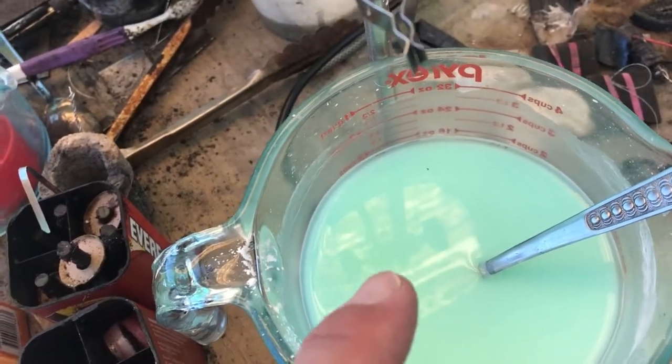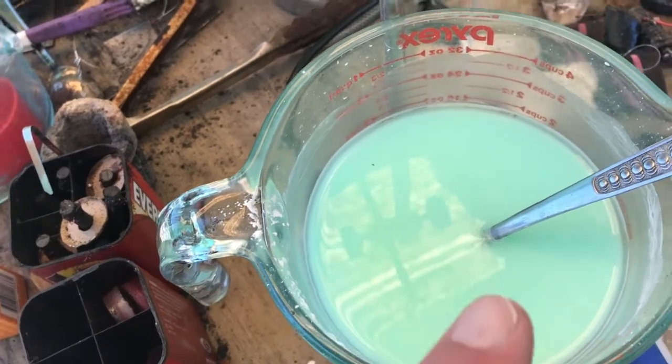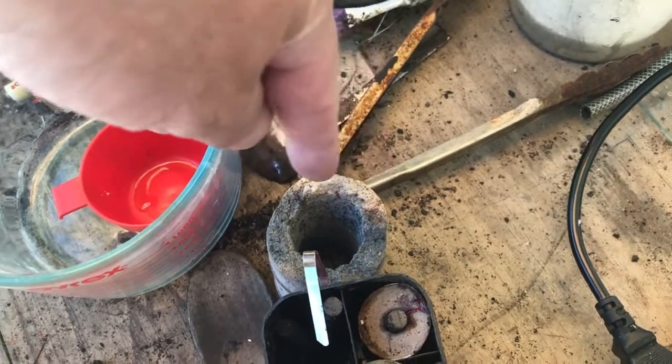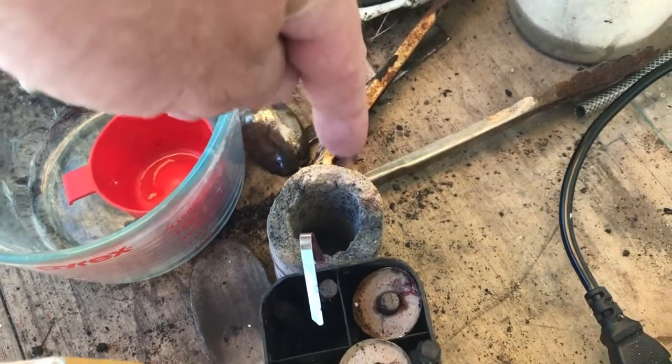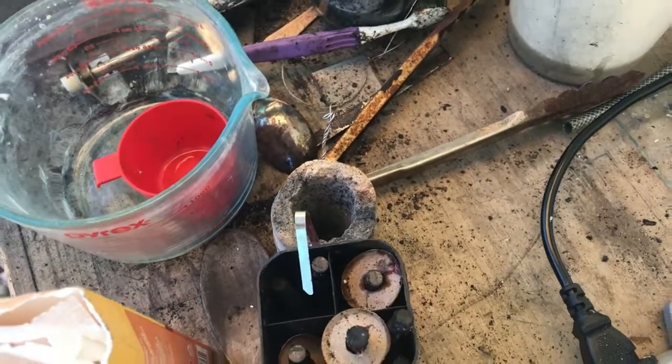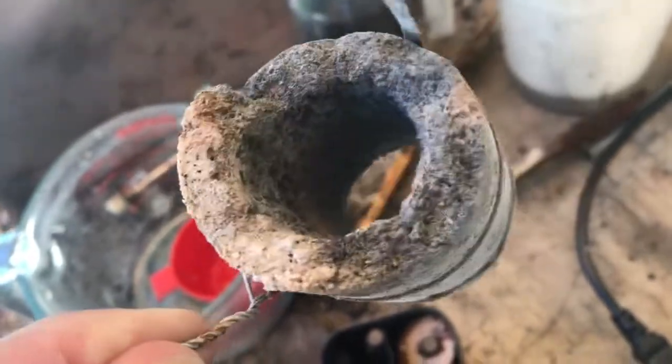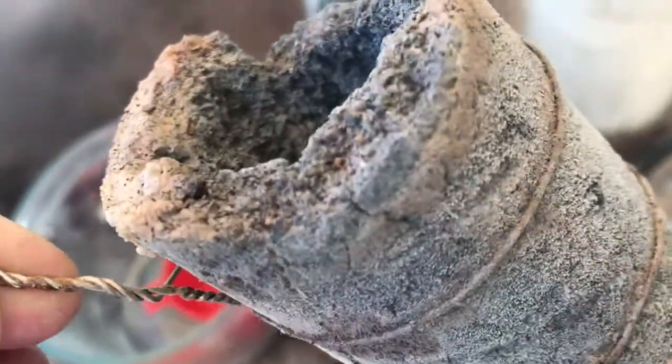The standard wheat flour wasn't a very good binder, and also adding graphite was not very good. The graphite seems to shear and make this cell weaker. The other one I got running now, which is on its 17th charge, is much better than this one. That was the negative of the last test though. It breaks apart too easy. The other one, which is a corn flour binder, doesn't break apart like this one. You can sort of see it in there where the zinc was plating to it, and it just breaks away.